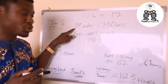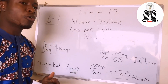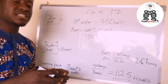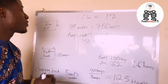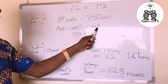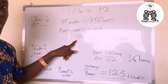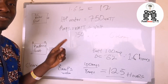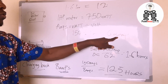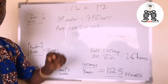If you take a mathematical calculation, one horsepower is equivalent to 750 watts. Now, to get the amps that the DC motor draws from the battery, the formula is watts divided by volts. The watts of the DC motor is 750 watts, while the volts of the DC motor is 12 volts. Dividing 750 by 12 gives us approximately 62 amps. So the DC motor consumes 62 amps from the battery.